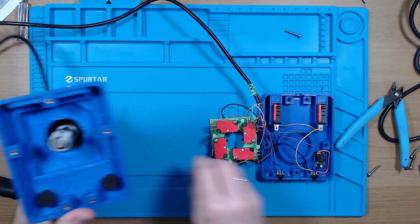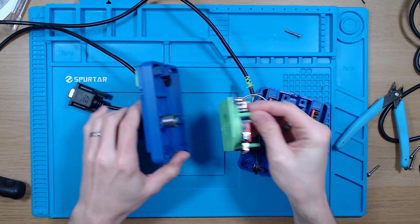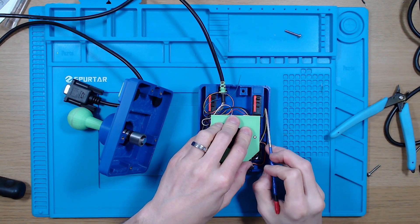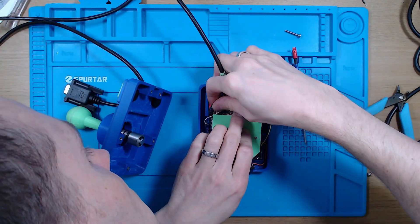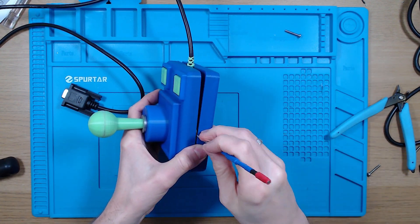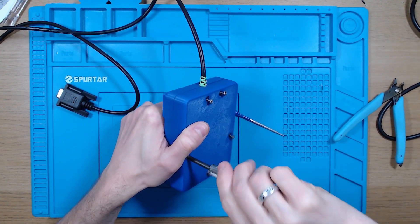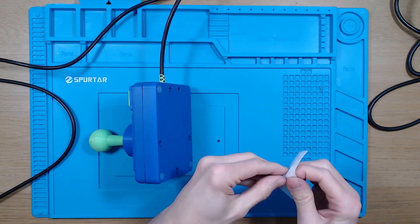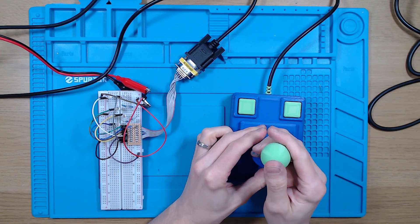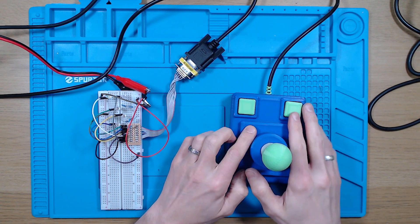Now that we're happy that it's wired up correctly, we'll assemble the case together. The easiest way is to rest the directional switch piece in place, carefully move all the wires out of the way making sure none of them cross the middle and all of them are inside the case. Then I clip the cord grip into place as well. With a little bit of waggling the top should just slide straight on, and then we can put our screws in and screw it together. Then there's a little bit of a finishing touch - I'm putting some little rubber dots on the bottom so it sits nicely on the table. Then I'll once again bring in my joystick tester just to make sure that we haven't knocked any of the wires off. It appears to be working. Let's try the fire buttons - yep. Let's separate them - now we've got two fire buttons. How about the rapid fire? That seems to be working great. I've re-recorded this with the audio on it and you can really hear those micro switches clicking.